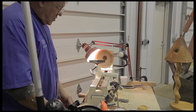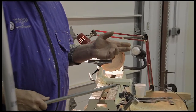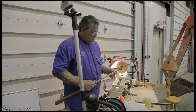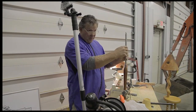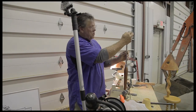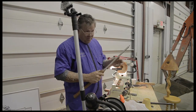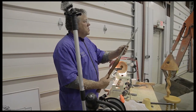There's another tool that's very helpful. A long time ago, 10 years ago at least, I had a gentleman here from Texas, and his name was Raul Pena. Very good turner. And he gave a demonstration on how to make hook tools by taking a piece of oil hardening drill rod, come soft, and we bent these little hooks and we sharpened them, and he showed everybody in my shop down here how to use them before we had a turning club. It was a long time ago. We even heat treated them, and that's quite a process. But this is one of the hooks that I've made.